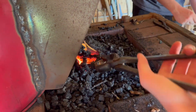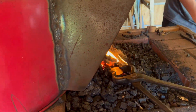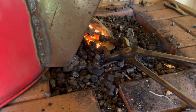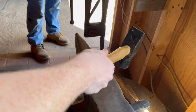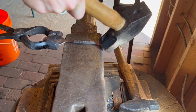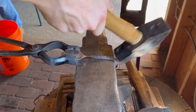It was really hot that day when we forged — super hot in that shed — but still super fun to do and I'm so glad I got to do this. What we did was we heated up our spoons and first actually flattened out the curved spoon part, just so it was easier to hold on to with our clamps once the metal was hot and workable. It bent pretty easily and made a ring really fast. Once you got the hang of it you could get a ring out within about 10 minutes.